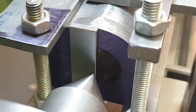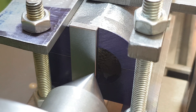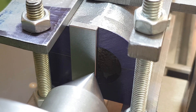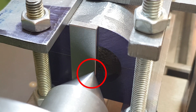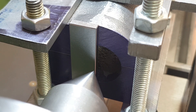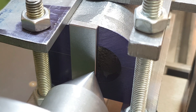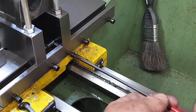To align the vertical centre line of the cylinder to the centre of the spindle I'm doing it by eye. I've got a parallel against the front face of the cylinder and you can see here where I've visually aligned it to the vertical centre line. Further down on the parallel I've got the centre of the spindle — represented by the centre that's in the spindle — aligned to the same edge on the parallel. It won't look quite parallel in this picture because of the angle the video has been taken at. And with it centred I lock off the top slide.